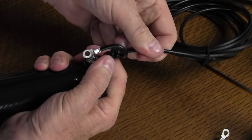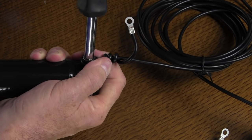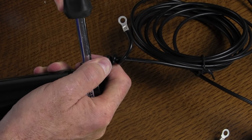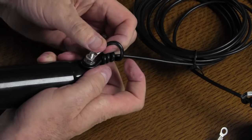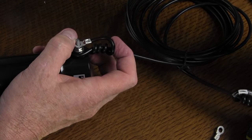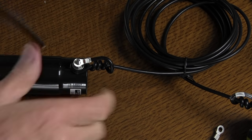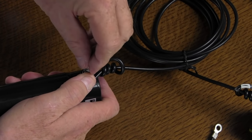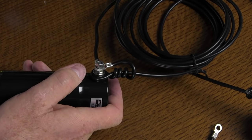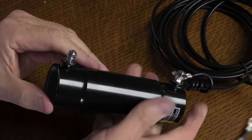Verify that you have just a little bit of slack so there's no tension being pulled on here. Give it a pull and tighten down the clamp that holds the wire — it also makes the connection for the trap. Again, just turn it until it's real snug, but don't turn it so tight that you crack the ends of the insulation material. Put that on like so, then get a tuning stub — they're all the same size — put that on, add the lock washer and stainless steel nut, and snug it in there with the nut driver.